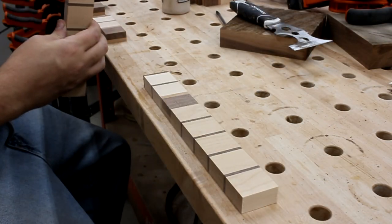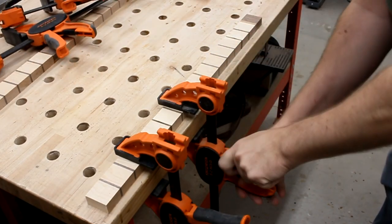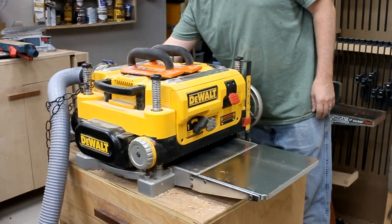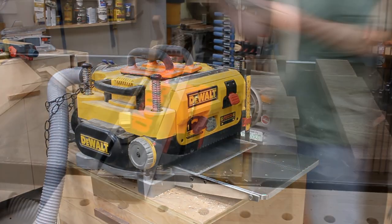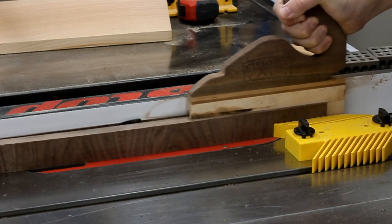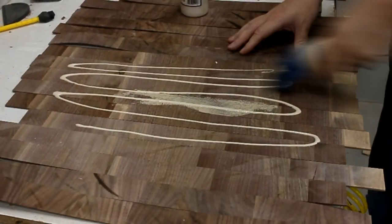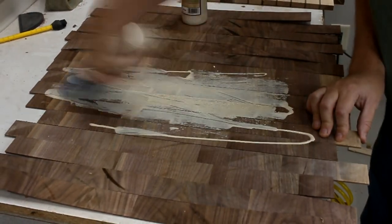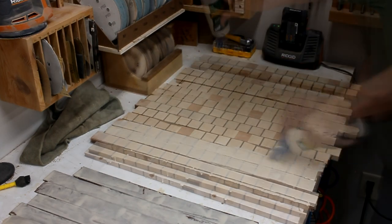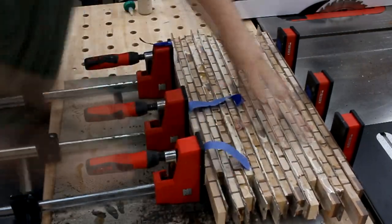Fortunately, I could salvage much of what I'd already made. I ripped each horizontal row apart by cutting down the mortar lines, planed off the remaining walnut, and began to make complete strips by gluing all the pieces together. Once they had dried, I scraped off any squeeze-out to keep them all perfectly flat. I had to make all new horizontal mortar strips, so I glued up some more walnut. This time I made sure to make it long enough so that a single strip would span the entire width of the board. I plop all the pieces down, organize them, and make reference marks so I can reassemble it correctly once the glue's been applied. Then I spread out all the pieces and used a glue roller to quickly and evenly apply a liberal coat across all of them. They all get placed back into the clamps, I line up the dots, make some last-minute adjustments, and tighten it down to dry.